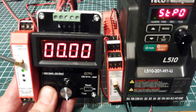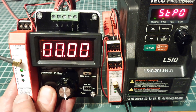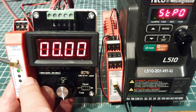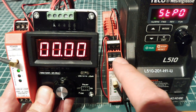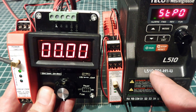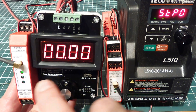This is my wireless setup. On the left, I have my transmitter — a one watt transmitter that runs on 902 to 928 megahertz, the ISM band, so it's license free. I have my 4 to 20 milliamp current loop feeding the input of this transmitter. It's transmitting that data — the value of the current loop — over to the receiver, which will mirror the current it sees on the transmitter and output it to the variable frequency drive. The distance between the transmitter and receiver could be about two miles. You can see the antennas on each radio.